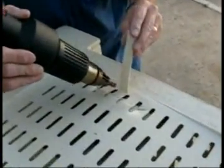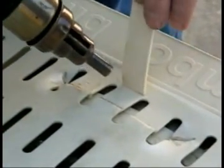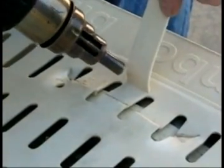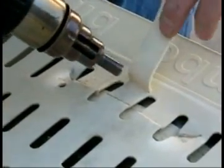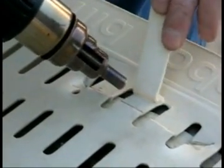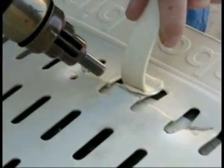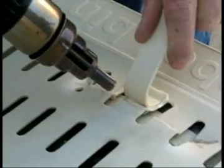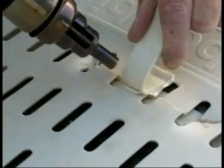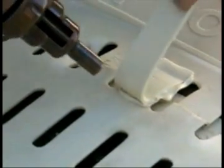As an alternative, welding can be done with a filler strip on its own. For this purpose, the feeder nozzle is not used with the welding gun. Start by heating the filler strip and then push down on the bin whilst heat is applied to both the strip and the bin. Push the strip slowly forward and make sure a molten wave of plastic forms in front of the strip as it is being applied.